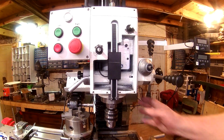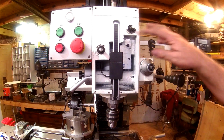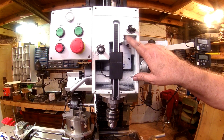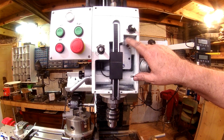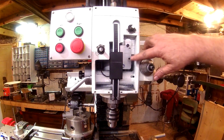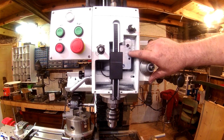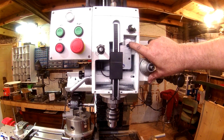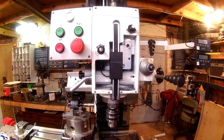We're mounted back on. Our collar around the spindle is tight, bracket in. I was able to find a 5mm socket head cap screw instead of that Phillips one I had earlier. But everything has got Loctite on it. The nut holding the factory bracket to this little scrap piece I found and made a bracket out of is Loctited, and this is Loctited in. The screws in the back of the bracket are locked in as well.